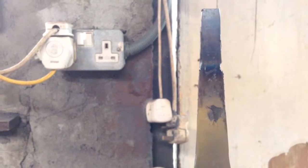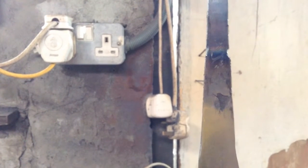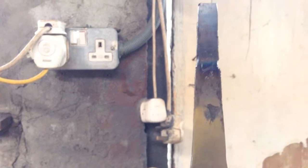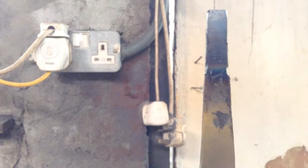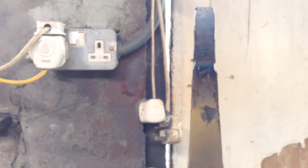And the straw colours are a pretty standard tempering colour for knives, so I'm not tempering this at all because it's actually fairly indestructible as it is, but you can tell the temperature range the steel's been heated to in the presence of oxygen quite specifically from the tempering colours that you see.